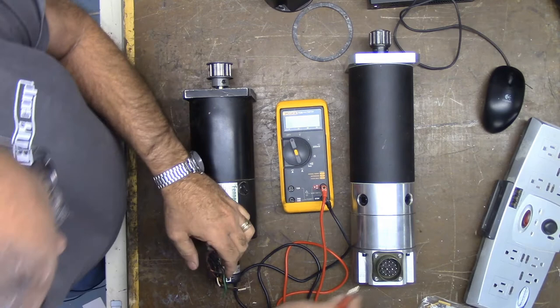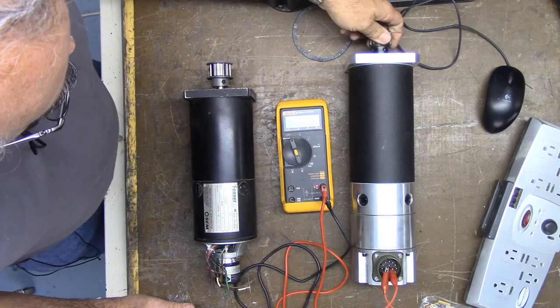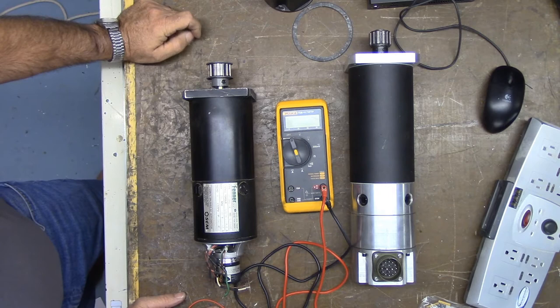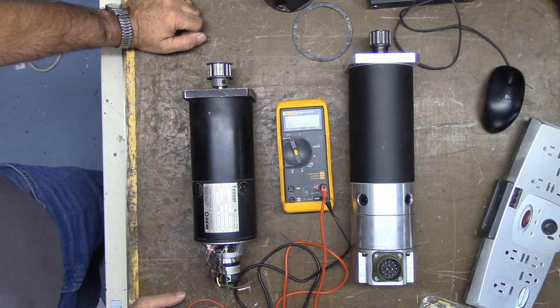Let's check the Servo Dynamics motor. Same thing, use a set screw. I don't feel any difference. It passes that test. It says if the resistance is not smooth but has skip spots, the motor is bad, and I don't have any skip spots. Note, if all three windings of AC servos are not shorted together, the motor will appear to cog when turned.